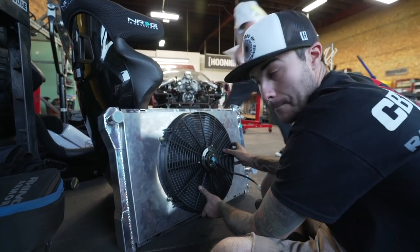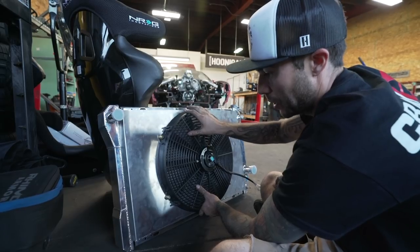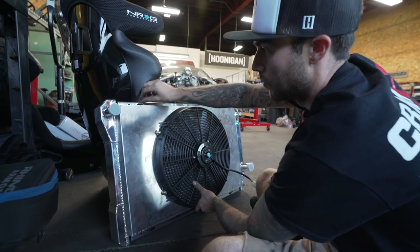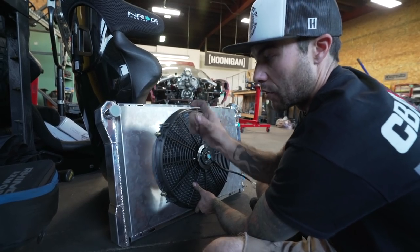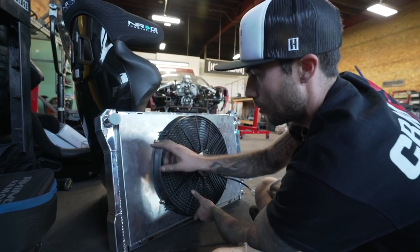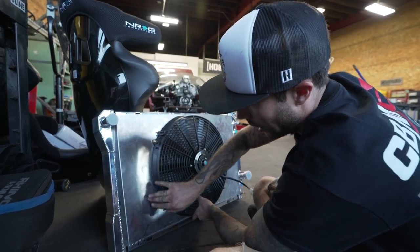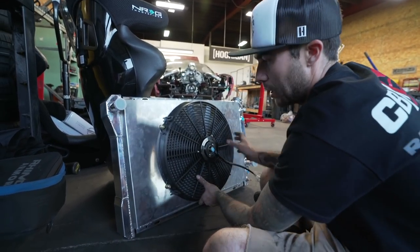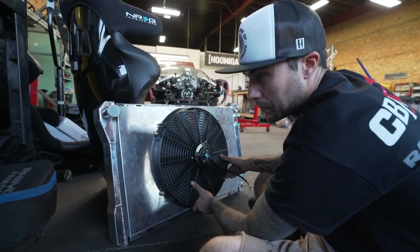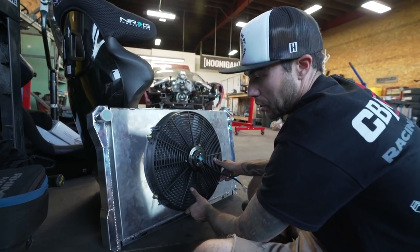What if you just made some tabs? Yeah, even if I made some tabs that came off here it might hold it pretty good. What I'm probably gonna do is — I can bend a 90-degree on thin short sheet metal pieces, I just can't bend a long 90 on a piece this wide. So I think maybe I can come off here, bend it at a 90, go all the way across here, and grab the other side — attach it boom boom boom. That might help. I don't think it's a for-sure thing, but it's worth a try.